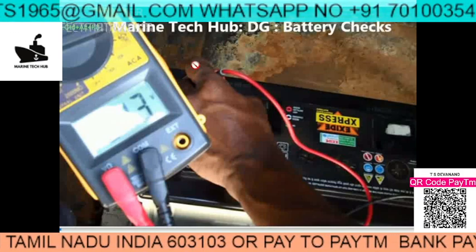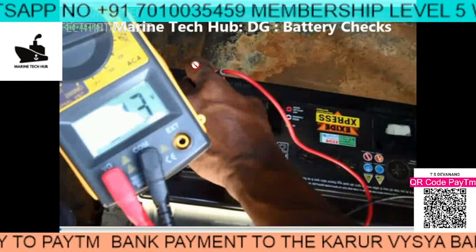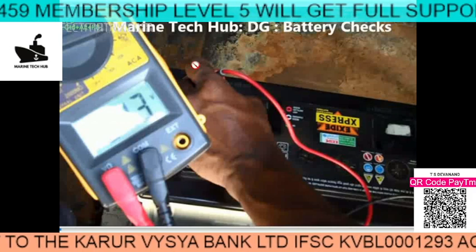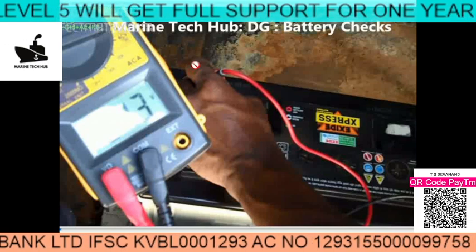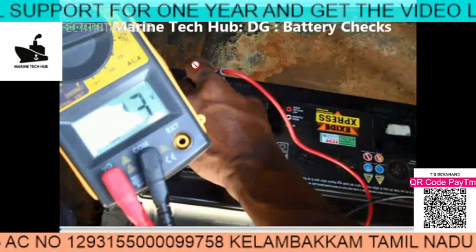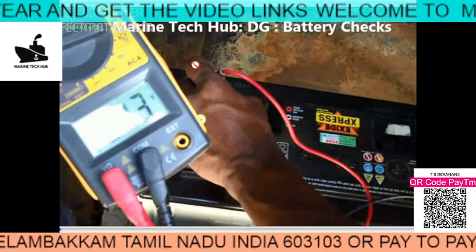Even with the new battery connected, the car was not starting. The jumper cable I was using was the same one I had used for five years. I tried yet another new battery and was getting frustrated. I called the service — he also tried the same thing but the car still wouldn't start. Then he said, 'Sir, your cable may be weak.' So I fabricated a new, thicker cable and the car started.